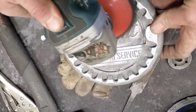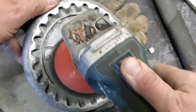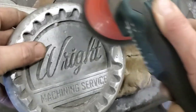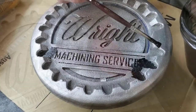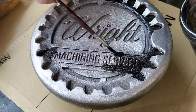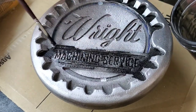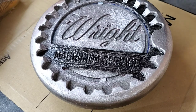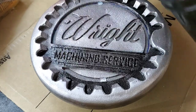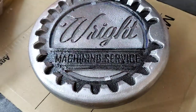Let's clean it up a little bit and see how quick it cleans up with a wire wheel. I've got a few ideas how we can make this really pop after we polish it up. My first step was to give it a light coat of paint on the background and this worked out quite well — it gave it a little bit of a translucent, almost anodized kind of look. I'm going to anodize some stuff a little bit later on, but that's going to be in summertime when I work outside. I think to do this project again I should have machined it first and then gone through this process, because I had to protect it while machining it later on.